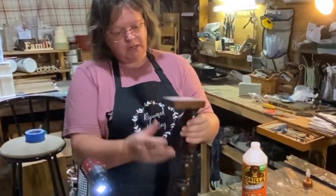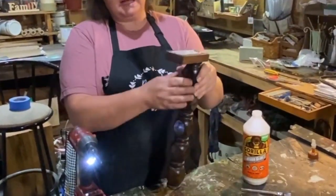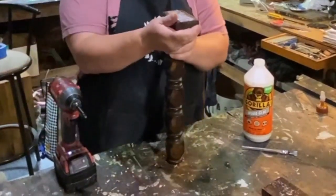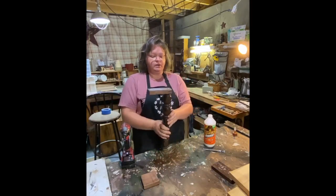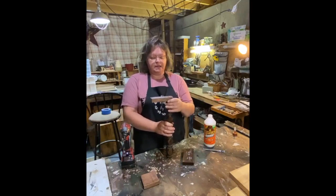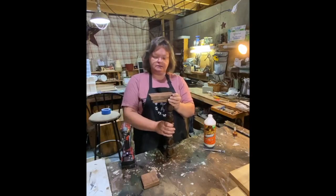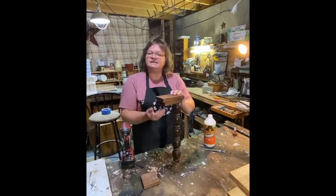As I'm doing this, because this piece has square sides, I want to make sure it's lined up straight with the front. I'm trying to hide the screw hole on top — I don't want to see that. So the second layer piece is going to be glued on top, and I'm also going to screw it from underneath where you won't see it either. That was the main purpose of gluing the top layer as well.